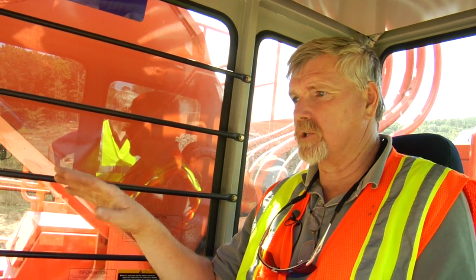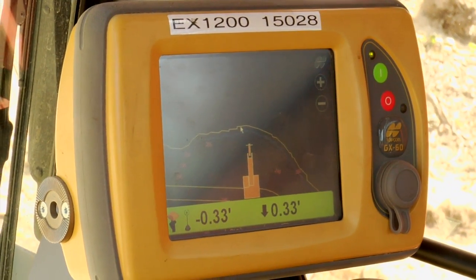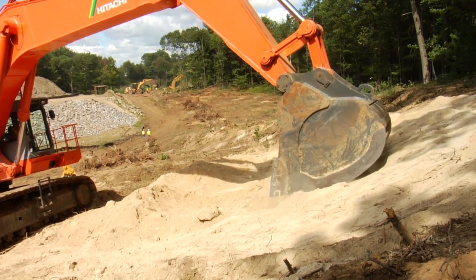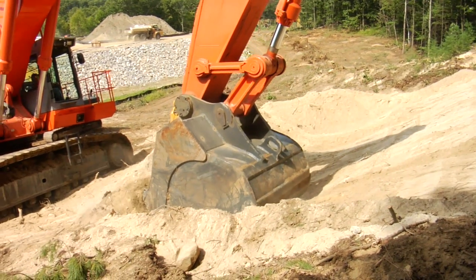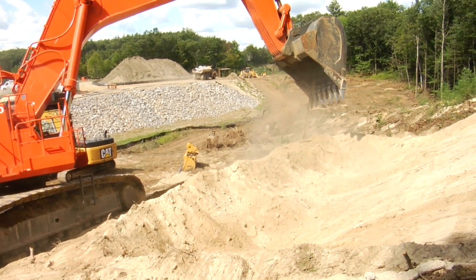It has all my slopes in it — the locations where slopes start and stop. I can see all that on the screen and pull in and out to magnify what I'm after. For example, I needed four inches of loam put on these slopes, so I added a cut to my slope so I don't have to go back and grade it for loam — it's done. We work a lot on slopes and hills. A 20-foot cut on a hillside slope — putting an offset stake in isn't easy — but I can climb up on piles, climb up on slopes, it doesn't matter the position. I can swing over and know right where I'm at. I trust this thing. The productivity is endless; the convenience is always there. Someone tells me to go do something, I don't need five other people to follow me.